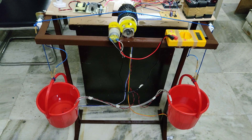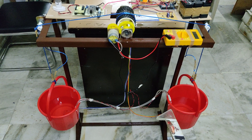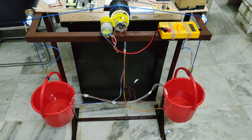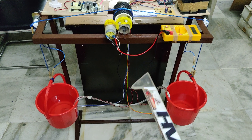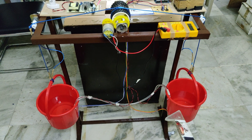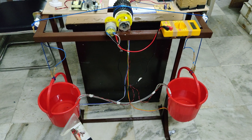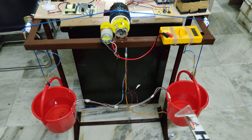The motors are placed under the bucket. When we switch on the kit, water will flow from bucket 2 to bucket 1. Under each bucket we are going to place SR04 ultrasonic sensors. The sensor will detect the ground level and inform the microcontroller. When bucket 1 is near to the ground, the motor in bucket 2 will turn off and bucket 1 motor will turn on, so that water inside bucket 1 will be sent to bucket 2. In this manner we are shifting the bucket positions up and down.